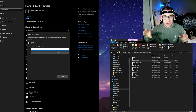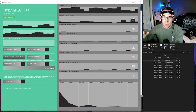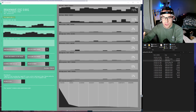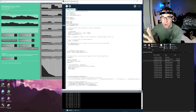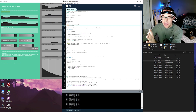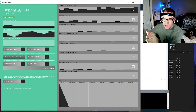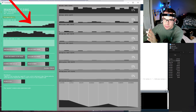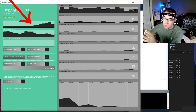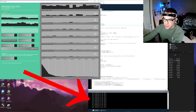After connecting the headset to a computer, I use two different programs to interpret the data and move the cups. The first program I'm using is Brainwave OSC, which gets all the raw data from your headset and breaks it up into different attention levels and meditation levels that you can look at in these charts. The second program is coded to grab the attention levels from program one, and once a certain threshold is broken, send a signal via the serial port to an Arduino which moves the cups. The data in the top chart is being grabbed by the second program and it's displayed at the bottom of the second one.